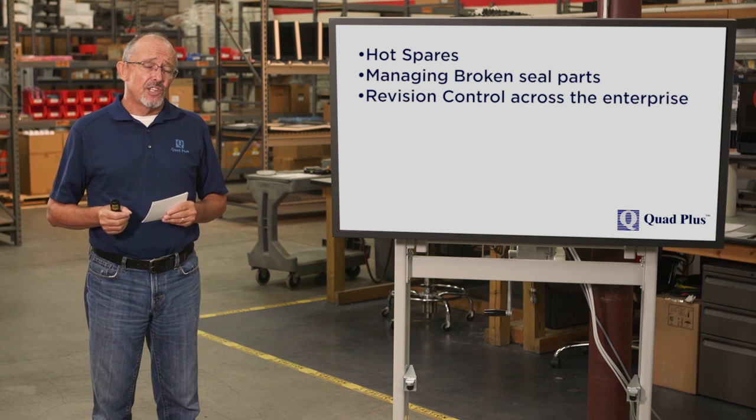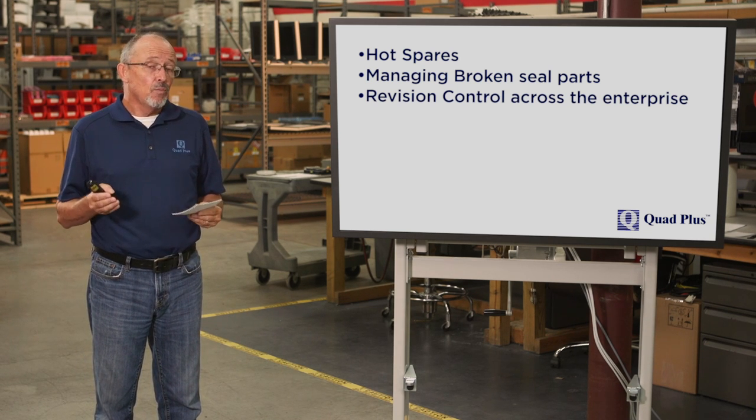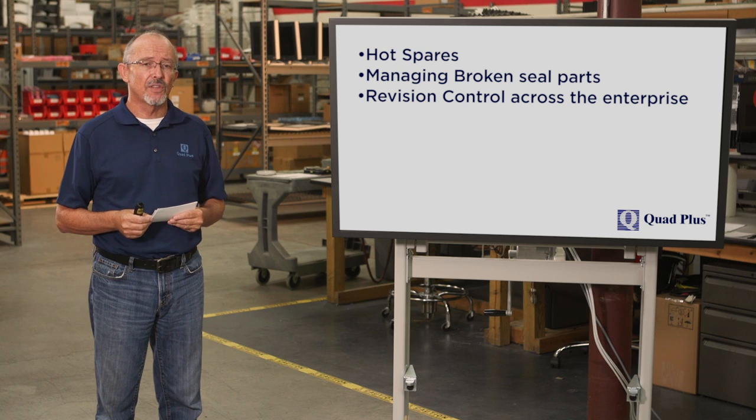Revision control across the enterprise. This is important in that if you're not careful, you can get out of sync even within areas of your plant, where your spare parts over time are no longer compatible with the equipment that's installed in the field. So it's very important that if there are new revisions entered into your system, there is at least a compatibility understanding, so you know what has to be done.